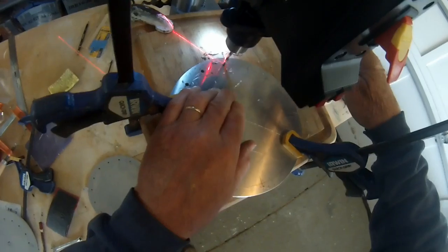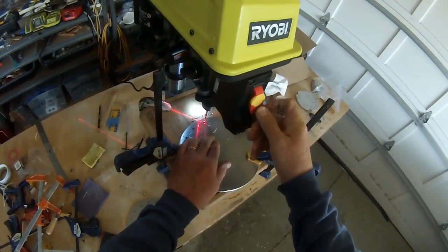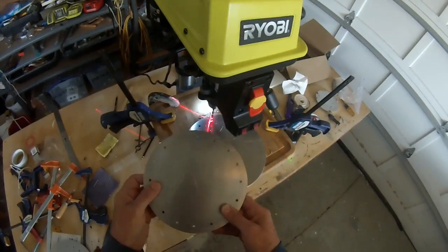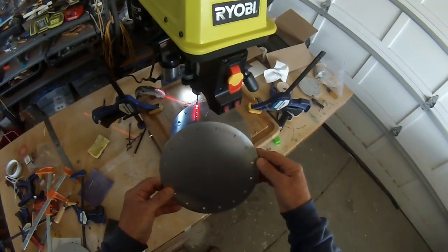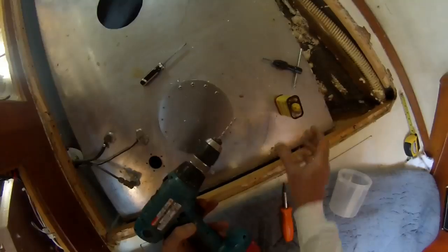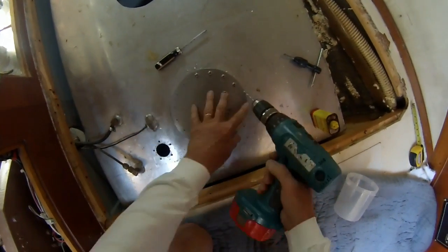We had to have something to cover up those 6-inch holes, so I had a local metal shop make me three 8-inch diameter 1/8-inch aluminum plates. And under the drill press, it was easy to drill a concentric circle of pilot holes. If you haven't drilled and tapped aluminum, it's pretty easy to do.